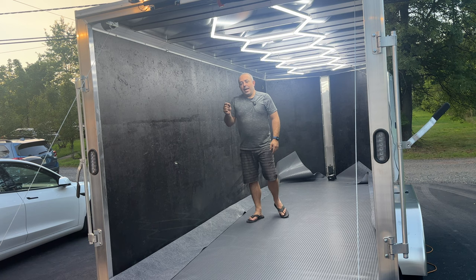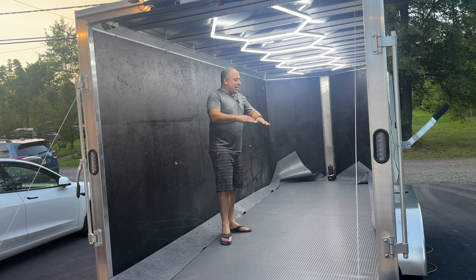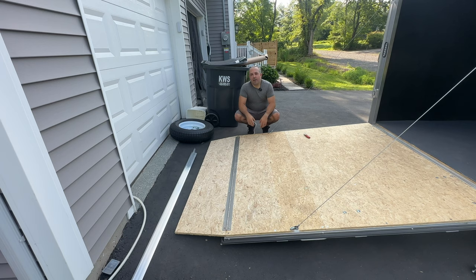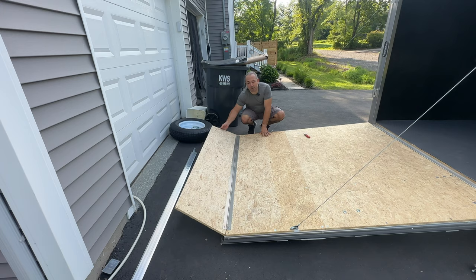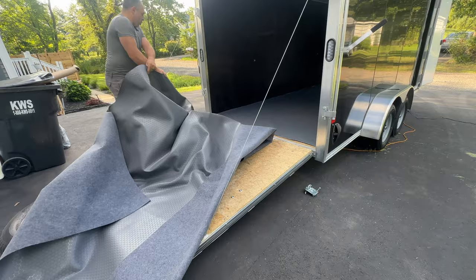If there are little errors in your cutting, it's okay if you're using trim pieces on the bottom, just like in your house where you put trim along the bottom to hide where your flooring and wall meet. Same thing here — it'll cover up any little mistakes. I love the look of it already. The back hatch needs a little bit of work. I'm actually going to remove the transition flap for this install because the hinge is just going to get in the way. If you want a very clean install, removing the hinge, applying the flooring, and then reapplying the hinge on top of the flooring will look its best.